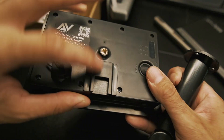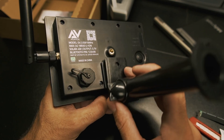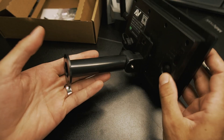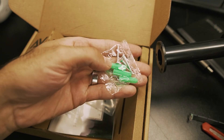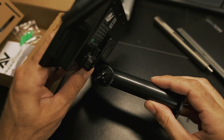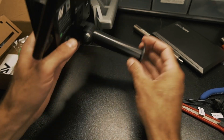There are some drawbacks — one of them being the mount kind of sucks. I especially don't like the base; it's just really small and it seems like it could be bigger. A lot of people like to mount stuff like this to a pole, and this isn't compatible with that. On the flip side, it is detachable — it has a nice pocket here. If there's enough demand, I'm going to custom design a mount that can interface with this, and design a pole mount as well. It is nice having something that can be mounted to any flat surface, a tree, something like that. You get screws in the box. The mount is adjustable so the panel can point toward the sun at an optimal angle, whether you have this on a horizontal or vertical surface. I located the SMA connector specifically on the side so you can orient the antenna vertically for the best antenna orientation, regardless of panel angle.